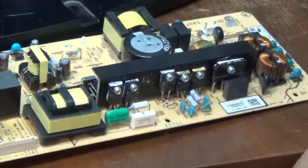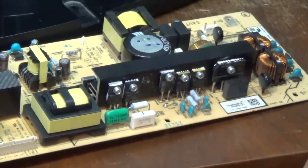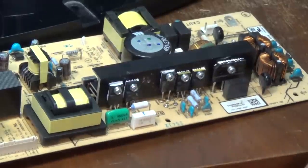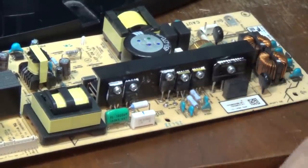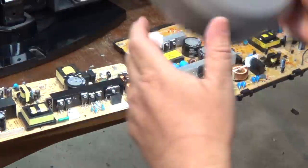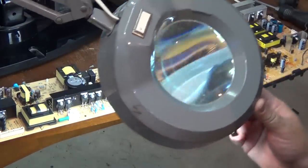I'm going to take a look at that other Sony TV I've got and see whether it has a comparable power supply. If we have the same power supply, I may just swap the entire power supply over. But if I can get parts off another TV to fix it, I'll go that route. The board is completely different for this other TV that we're going to scrap. The 2SK4096 is a 32-amp pulse MOSFET, and I'm going to replace it with these 2SK3568 on this board.